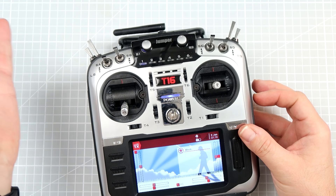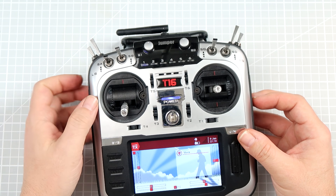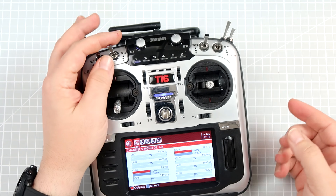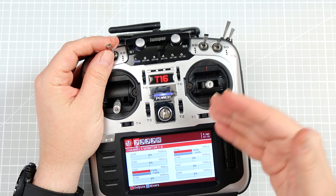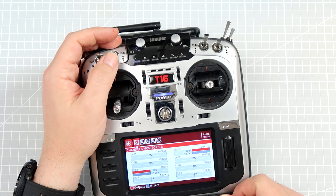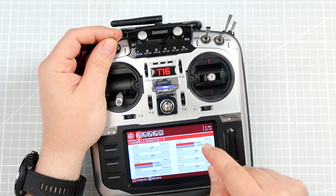This arming will happen exactly the same way, and if we switch it up then the flight controller disarms. Let's begin with the presentation of how it's working right now. Right now I have switch B assigned to channel 5, which on my drone is assigned as the arming channel, and if I switch switch B, as you can see, the arming channel is changing. This is not the behavior we want.